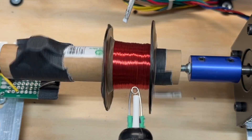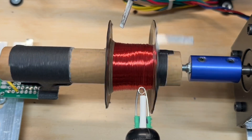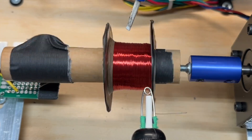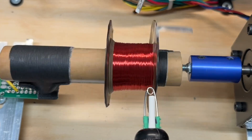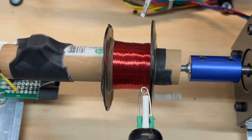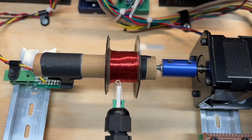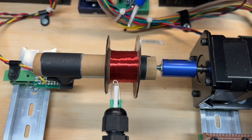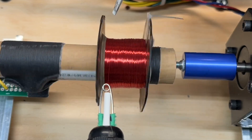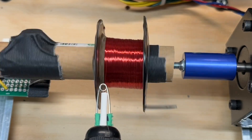You may be able to see this, but I'm starting to climb the hill where I've got more of a conical shape on the left side of the bobbin. We're getting closer to 100% fill across the bobbin area, though as mentioned there's a lot of overlap of the turns due to the shape of the bobbin. My new target will be 7083 turns, and I'll eyeball things to see how close I am to the outer edge of the form factor to make sure I still have a window.